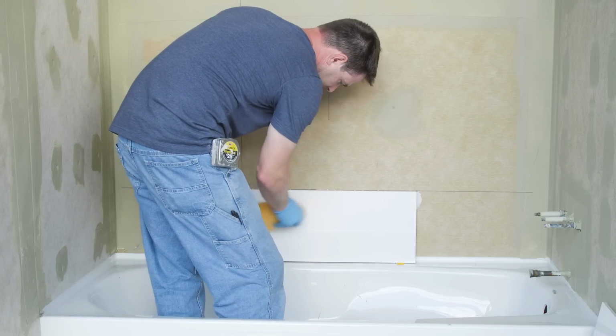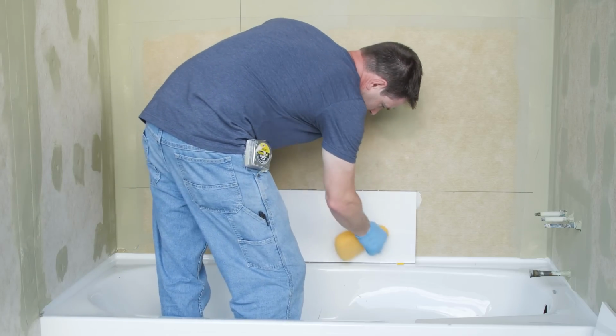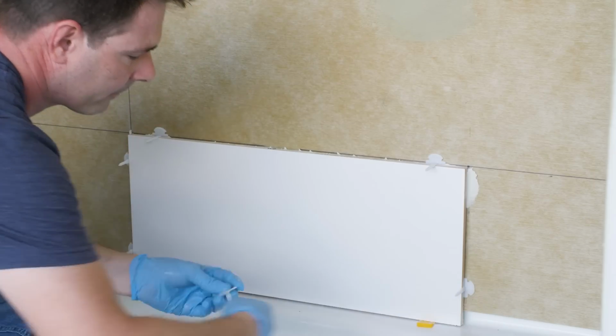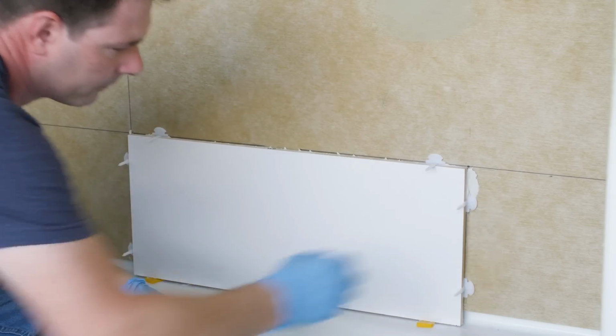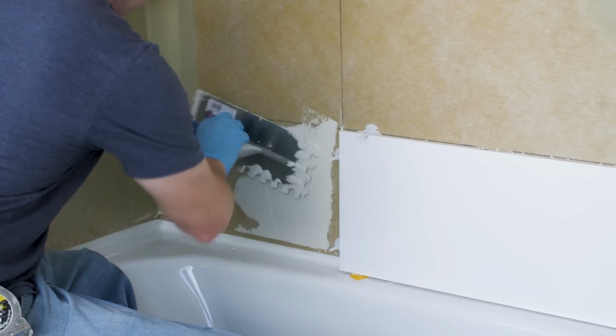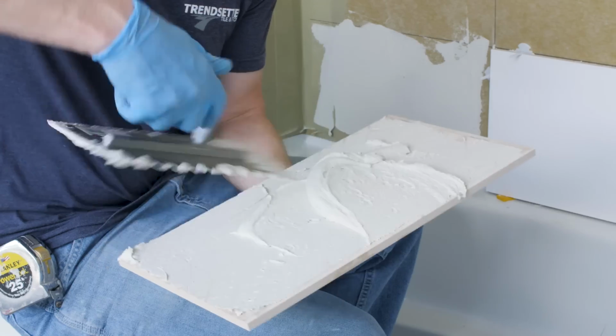Following the installation of the tile, take a moment to clean excess mortar from the tile face and edges, and then insert the base of the leveling system approximately 2 inches from the corners of the tile. Install the next piece of tile in the same manner. The base pieces of the leveling system also function as a spacer.